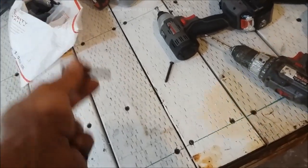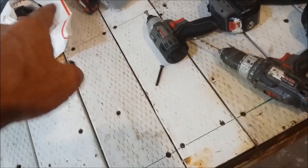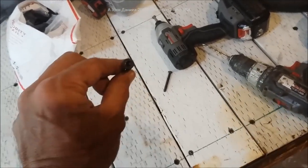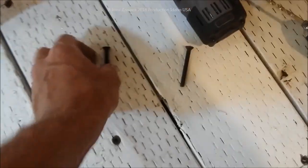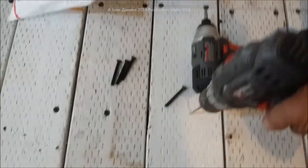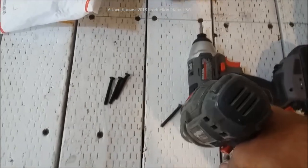These are two and a quarter inches long and they work excellent on deck boards. For trailer frame boards you can get them in an inch and a quarter — like for putting three-quarter plywood down in a cargo trailer or something. They are torx drive so they do not slip, and they'll send you 7/32nds-inch bits so you can drive them in. I'm going to show you how easy this is.